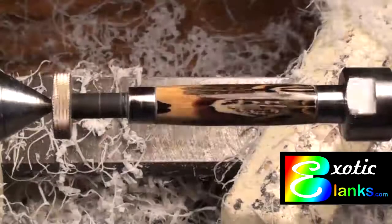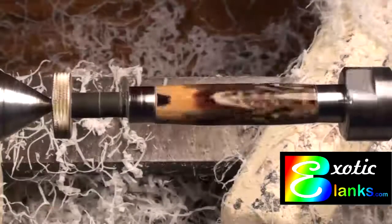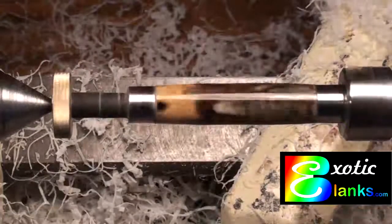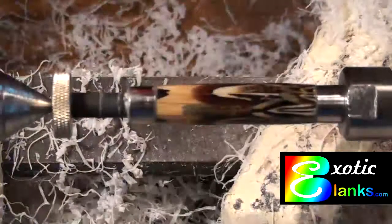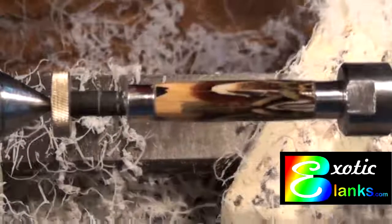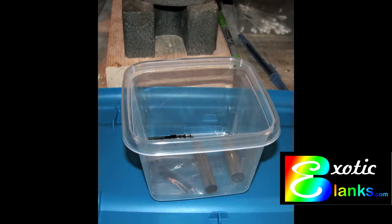So that's the polishing of it. We've used Novus 3, which is the heavy scratch remover, and then Novus 2, which is the light scratch remover. Now I'm repositioning the lamp so you can see the reflection off of what will be the pen body. It really turned out nice, as it usually will. Novus polish is a good product and that's a good way to do it on the lathe. I still prefer buffing, but if you don't have a buffing system, the Novus is a great answer for the lathe.